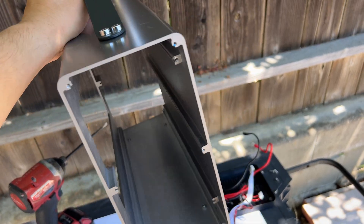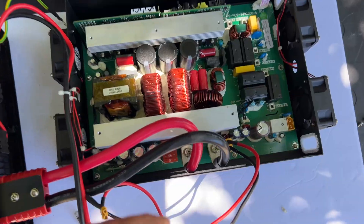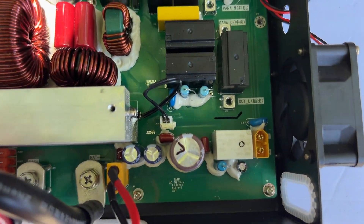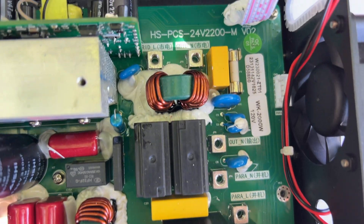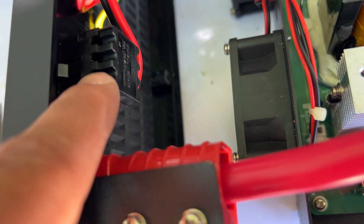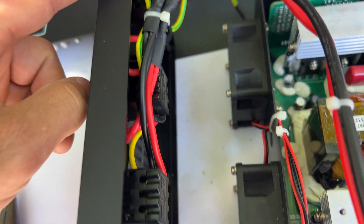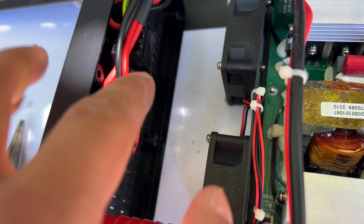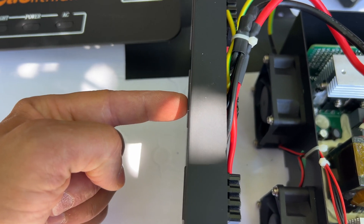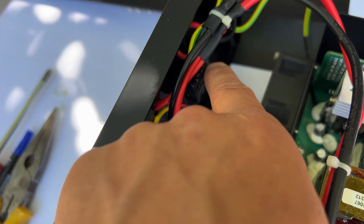Here's the station fully disassembled. We have a nice metal cover, and here's the inverter part. In my opinion it's a poor design for the AC outlet. All of those contacts are supposed to stay in place by a small cover with 4 pins, and if we push a plug hard into the outlet they're going to snap and it's possible that contacts will short.